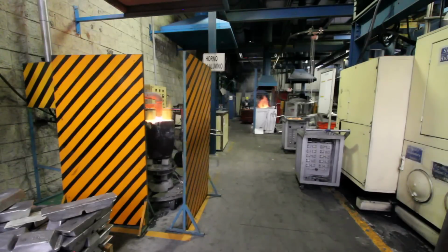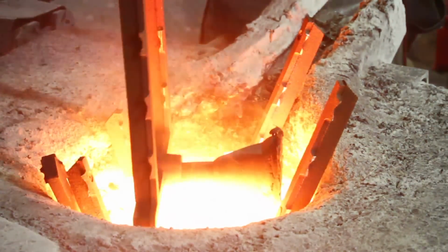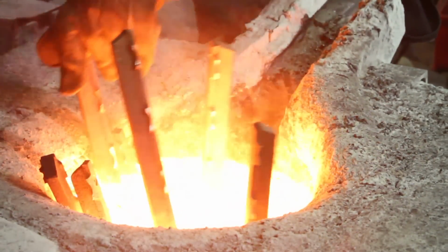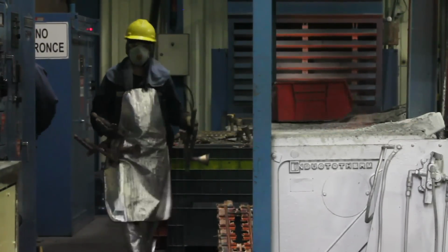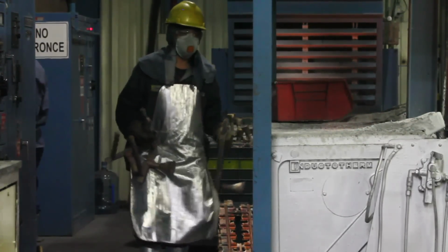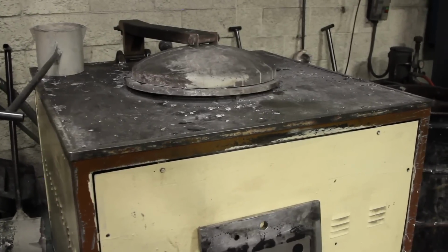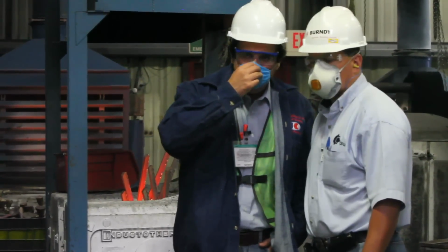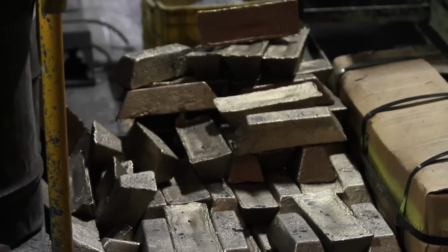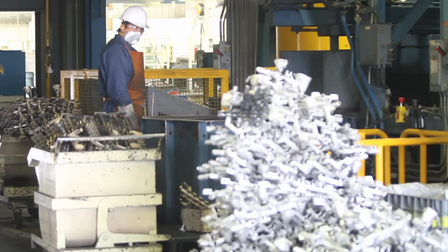While the molds are made in the Sinto machine, the metal is melted and prepared. For this, we have 2 induction furnaces for bronze melting, with a capacity of 160 and 180 kilograms of molten bronze, and 2 electric-resistance furnaces for melting aluminum, with a capacity of 800 and 200 kilograms of molten aluminum. For the preparation of the load, 60% of the ingot is used and 40% is returned.